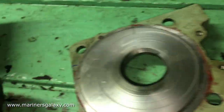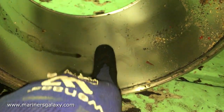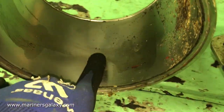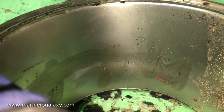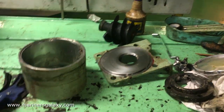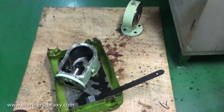I can feel that there is wear and tear in the casing — it's not very visible in this video, but if you feel it with your hand you can sense the erosion of material all the way along a circular path. This erosion is likely the reason why the vacuum was not developing. Now we have started cleaning the other parts of the pump.